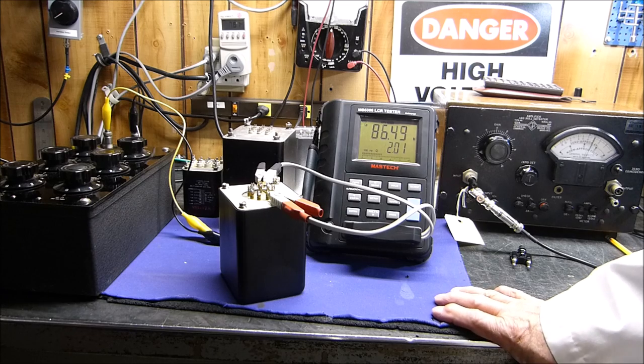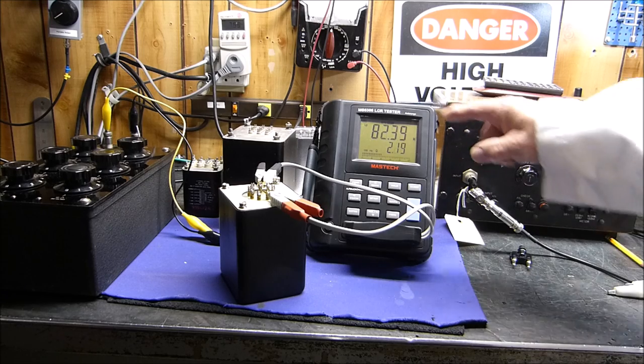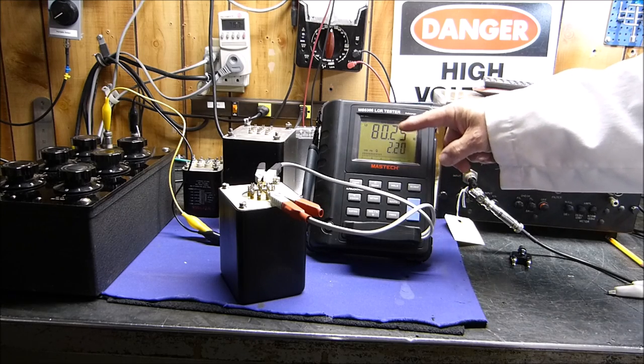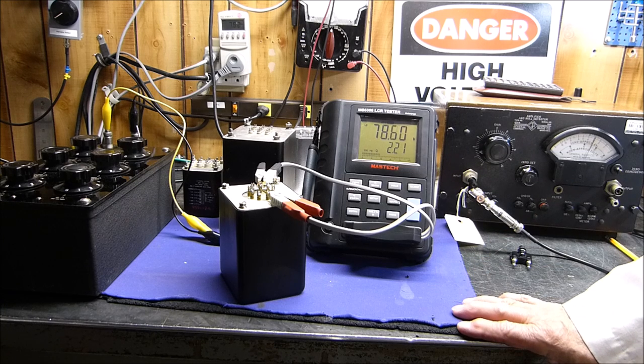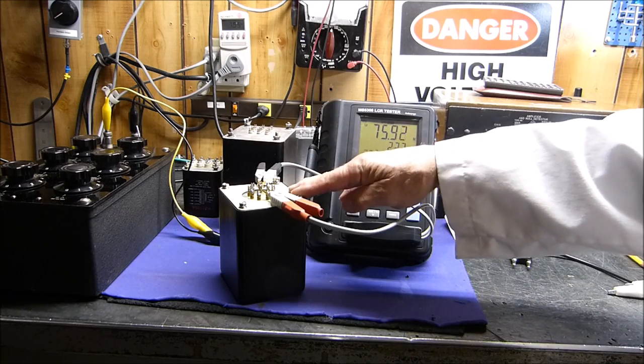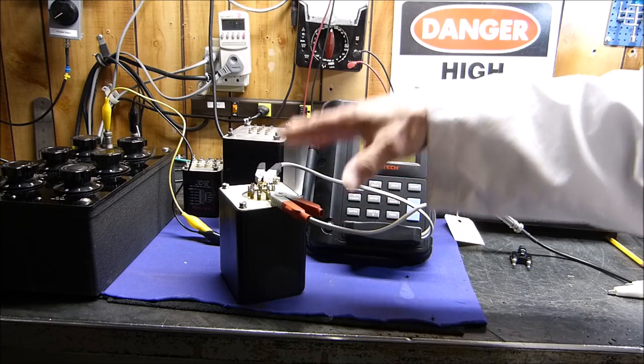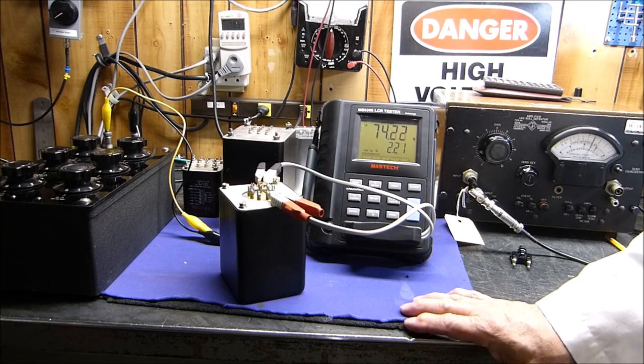We want to do it at a low frequency. We'd really like to do this down at 20, 30, 40 hertz. See, I think that's the answer right there. 80 henries, 70-something henries. That's coming down because when you start measuring these things, the longer you fool with them and tinker with them in a particular measurement session, the weirder they get.